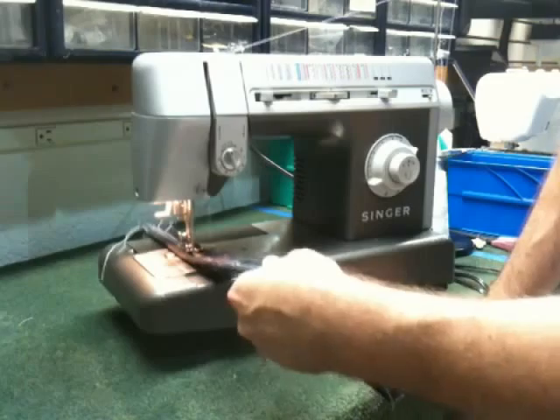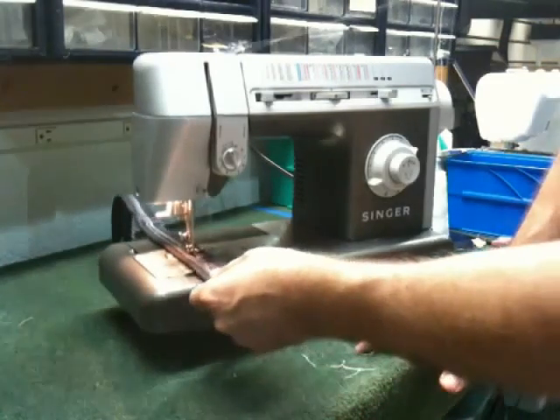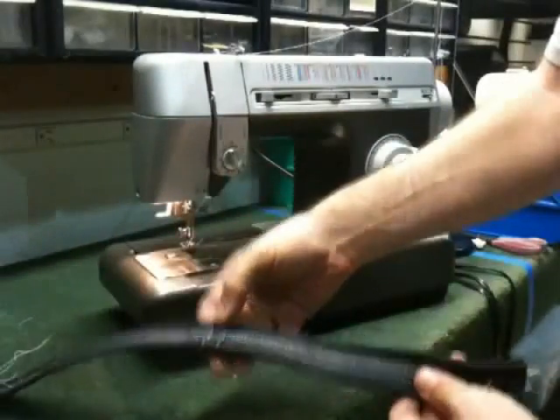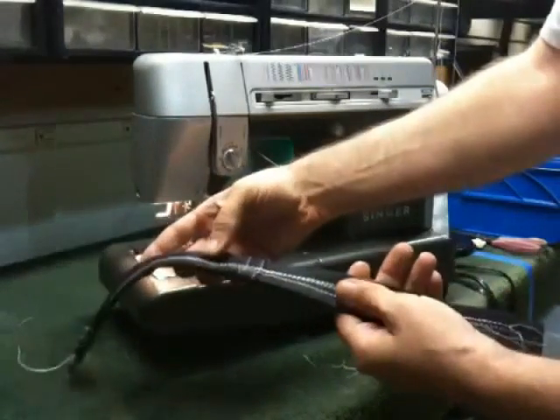So we're going to go from the three layers — it's going to go right up and over the nine, back down to the three. We'll check the quality of stitching and we do have nice tight, even, consistent stitching even through the nine-layer thickness change.